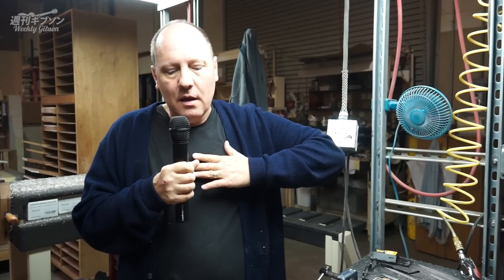One of the big changes on True Historic product this year is that we roll the frets on the binding before the neck is even put into the guitar. In the 50s, when Gibson made guitars, they made a fingerboard assembly, which was the fingerboard with the inlays in it, with the frets in it, and the binding on it. And then they ran the fingerboard on a shaper machine to start the rolling process.